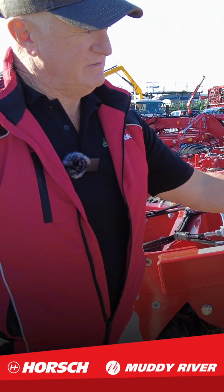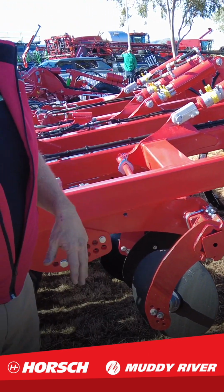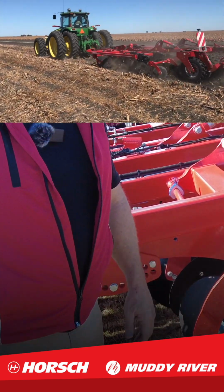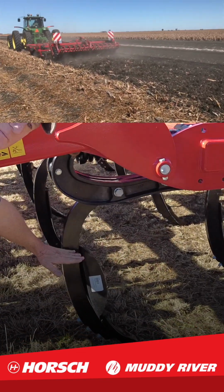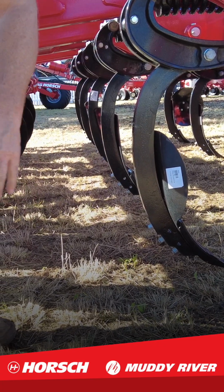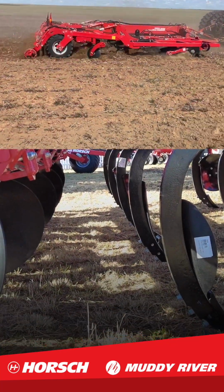They'll handle a lot of trash, this machine, obviously because it's a corn machine, but we use a lot in the cotton industry in Australia as well. People can come in and save 2, possibly 3 workings in cotton. They'll come through and pick, then they'll mulch, and they'll put this thing through. It's one pass, and it'll rip down to here. We've got down to around 40 centimetre, 35 in cotton rows, and even over in WA, in some situations in Western Australia, we've had this up to around about there. That's around about 40 centimetre.